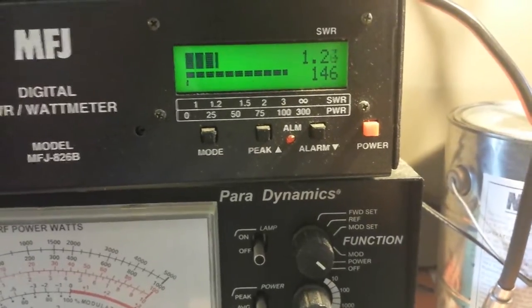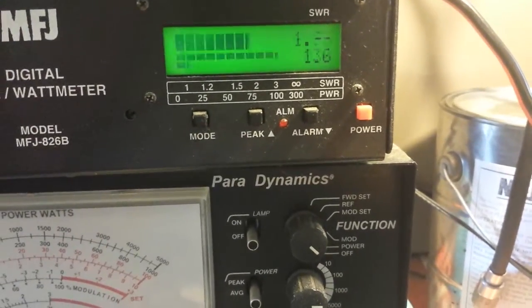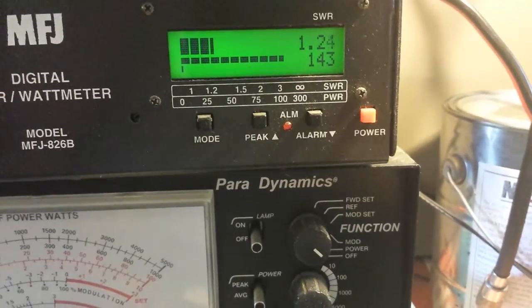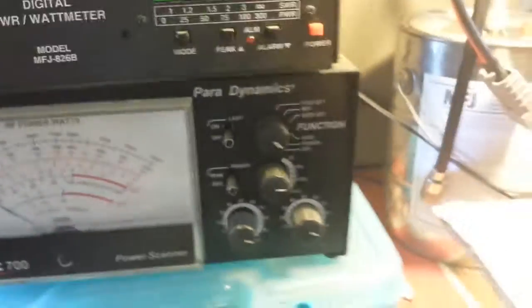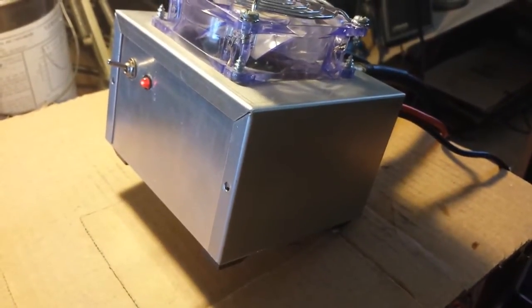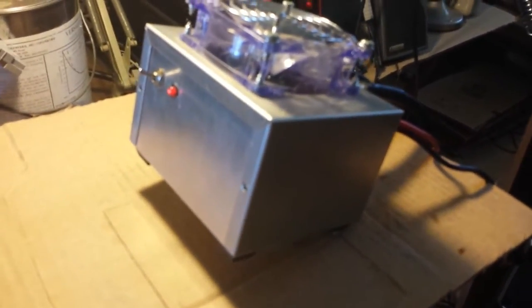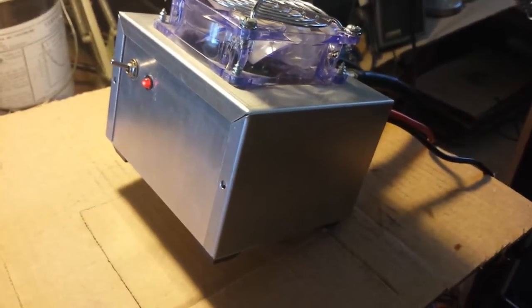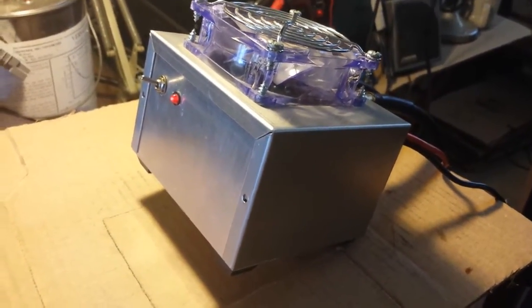Check, audio. Alrighty, right there about 140, 142. Check, audio. Alrighty, so you got you a decent 120 to 150, 120, 145 watt 1446 Class C driver. Modulator, whatever you want to call it. Hit it with a good hot radio, you could get it peaking up to around 180. But yeah, man, I'd turn this thing down, turn your radio down, drive it with a little 4-pill, a little 6-pill, something like that. And the 1446 is going to give that good scream and modulation, no doubt about it.